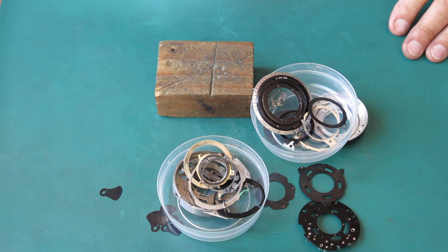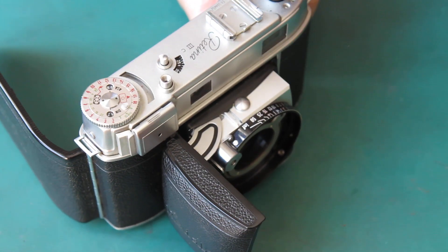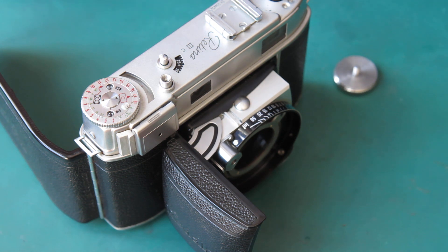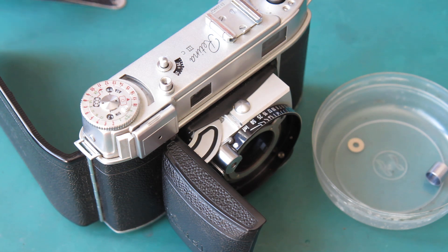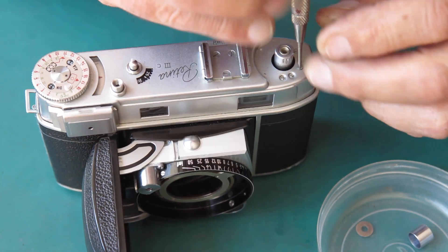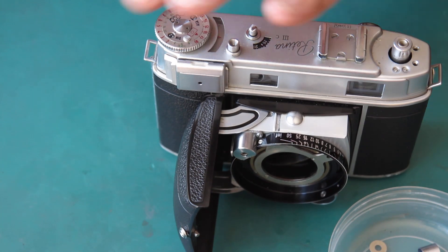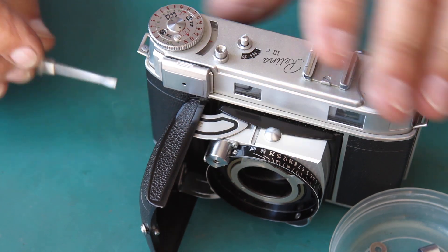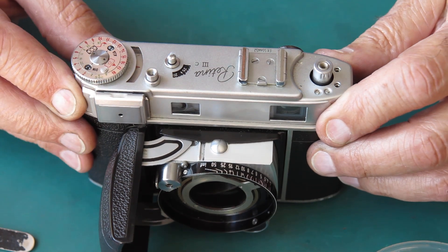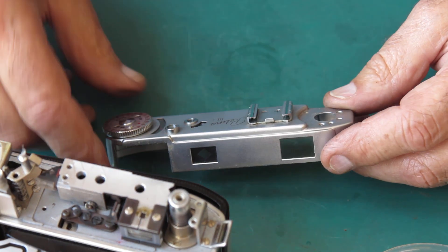With this shutter I'll have to clean all these pieces up and put this to one side. Meanwhile we'll strip the body of camera number two - basically a rerun of what we've just done. This camera is slightly earlier production - it does not have chrome-plated trims for the body edges top and bottom, it has polished alloy edges on the body itself. There are probably other differences between the two - one was the meter: the later camera had ASA speeds on the meter going to 650, on this one the speeds went to ASA 320. Let's have a look at the top cover.